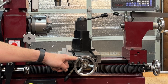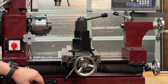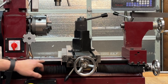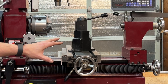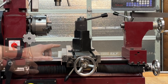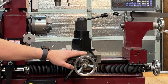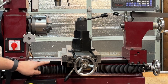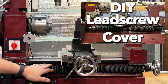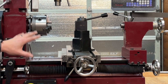Now they are both 3/4 inch, 10 threads per inch acme thread. So you can easily get a tap to make a nut for it, and easily get replacement bar stock with the threads already on it. This was a significant upgrade — practically brand new lead screws that are easy to replace in the future. I also found boots online and made really nice lead screw covers to protect my brand new lead screws so they would last even longer.